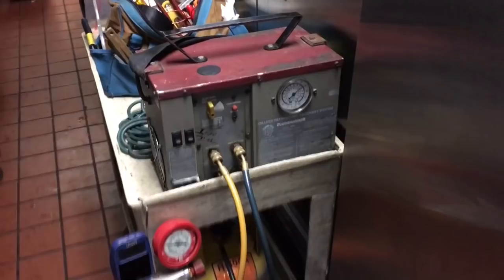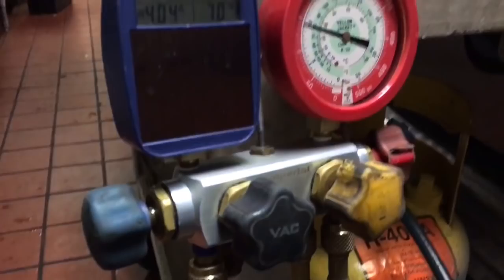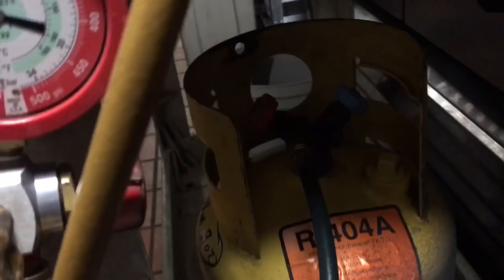Okay, recovery. First step. And this gauge is all hooked up. Oh, 150 pounds balance pressure we had when I hooked up. Okay, so open the suction and get the air out. Recovery. Open up the vapor. Alright. Now we gotta plug this thing in. Alrighty, so little trick I do on these units, I run a heavy cord underneath the units.